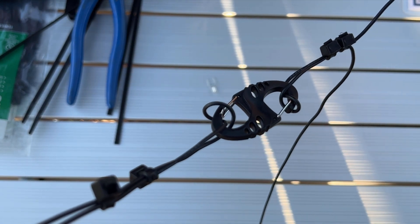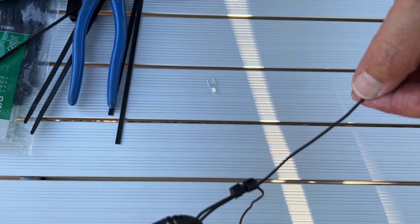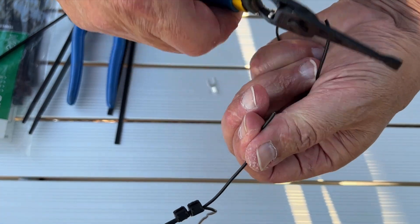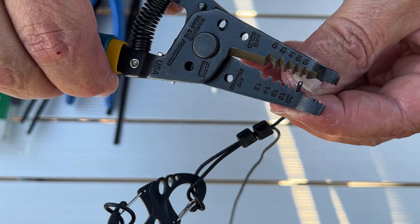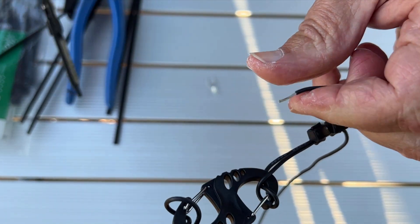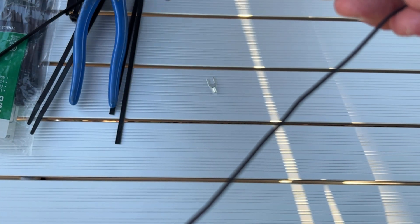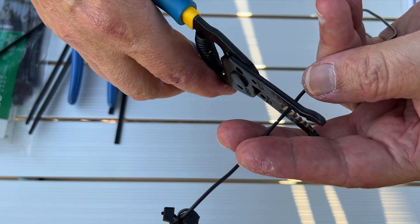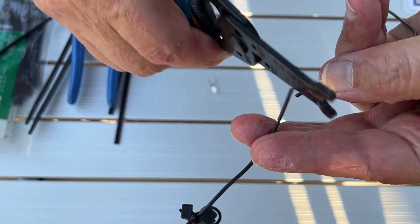Here's what I mean by MacGyver. We have both ends of the link dipole connected to the plastic carabiner. Here is my 33-foot-long section — we're just going to cut this, strip this, put it in a wire connector for now, and then we will obviously solder that later. Here is our other end that we have not yet taken out to 66 feet, so we're connecting at the link of the dipole that we're making.